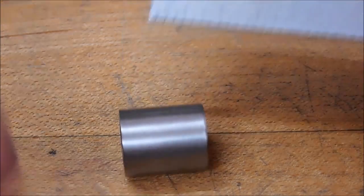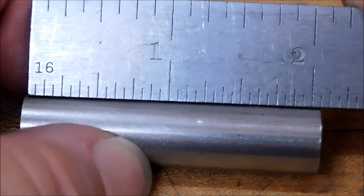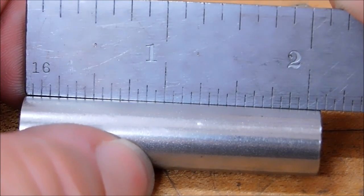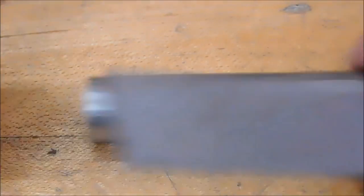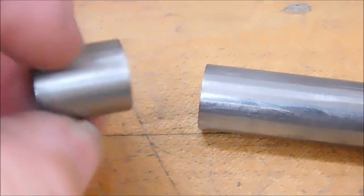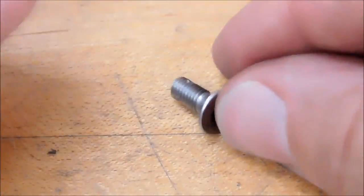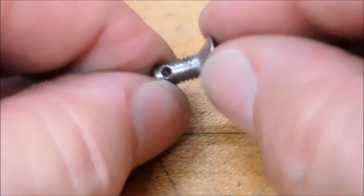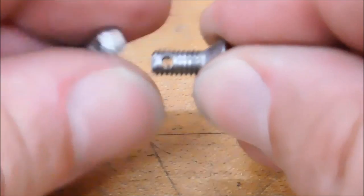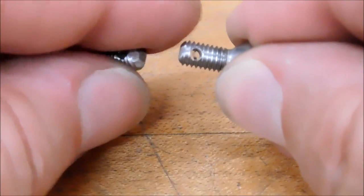It's about 600 long, half-inch in diameter. And this side is about 2 inches and change. 2 inch 060, let's say 2 inch 100. Could be anything, so long as I like to see this longer than the diameter. There's a reason for that. And we have two flathead screws, any size you want to pick, provided the head is smaller than the stock that you use, and pop a couple of cross holes in the end right there.